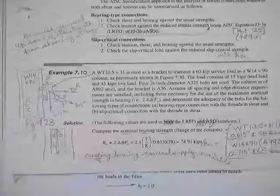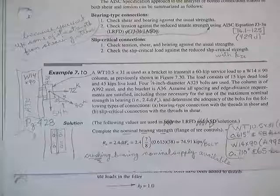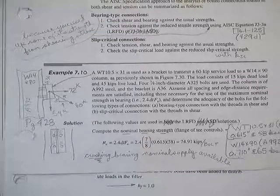Let's start on that example next time. The 10% increase in bolt force at joint separation is ignored — it's not usually reached. We rarely get that high.